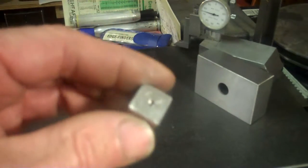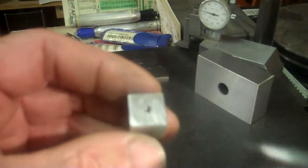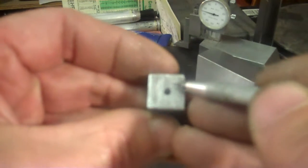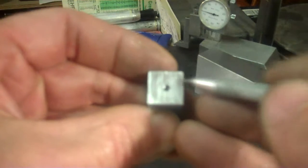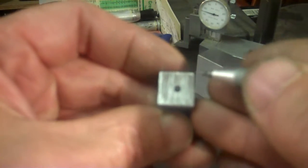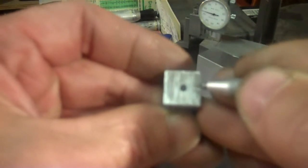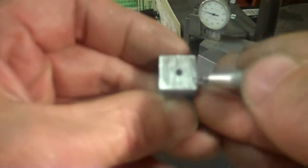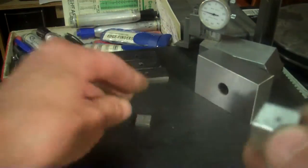The bottom flange will have to be reset back in my vise and reset again, and that will have three at a 120 degree angle here, three ball bearings that will be seated in here, that I'll use an 1/8 inch ball mill, and I will spot drill at 120 degrees, so I have a triangle here of three ball bearings seated, and that should give me the ability to make that rotate back and forth with the ball bearings.